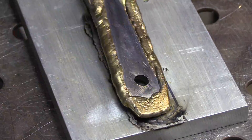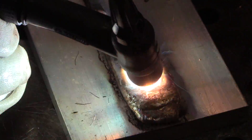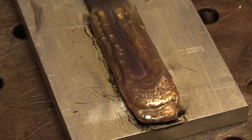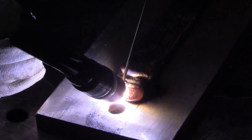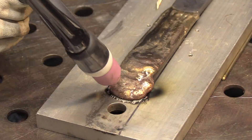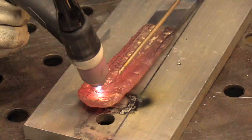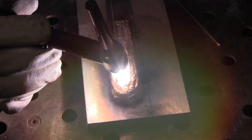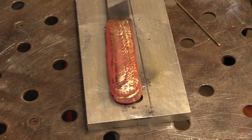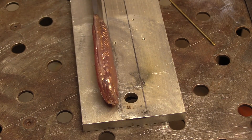Here it's just sped up and I'm able to periodically wire wheel, sand, and whatnot to get a good clean surface so that it flows. After I get a full layer of aluminum bronze on with AC, I'll switch to silicon bronze — mainly because I didn't have enough of either one to finish the job. I like aluminum bronze for the first layer; that little bit of aluminum kind of retards hardening on the fusion layer, which is also a good thing on cast iron repairs. It takes a lot of beads, and I'm rushing it a bit — you can see it getting red hot here and there. But a funny thing happens: because the bronze is so much more thermally conductive than the steel, even though it's red hot, it's still pulling heat out of the steel. I can hold the steel on the end no problem even after camping out a long time building this up.